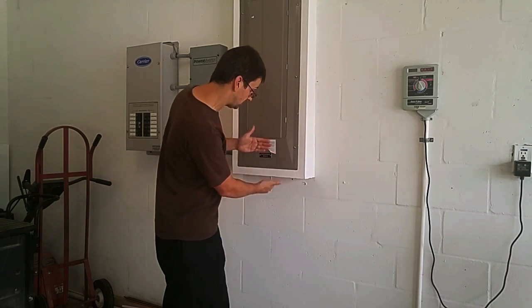If I'm going to do any real projects in this garage, I'm going to need a little bit more power than what they gave me. This project is as straightforward as it comes: one outlet, one circuit, and the run is all of maybe two feet below the box. It should go pretty smoothly. That'll allow me to put my larger tools like the table saw and the joiner on a separate circuit from the dust collector, both of which use a lot of power and can't be on the same circuit.